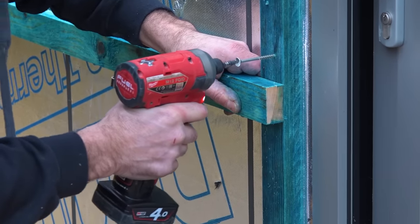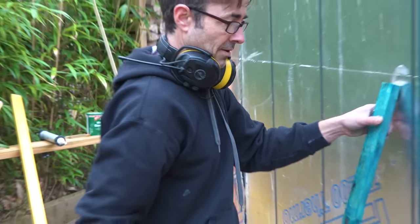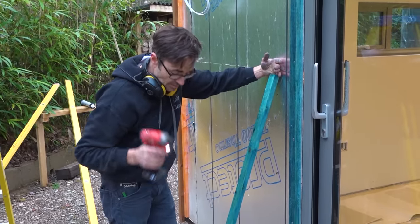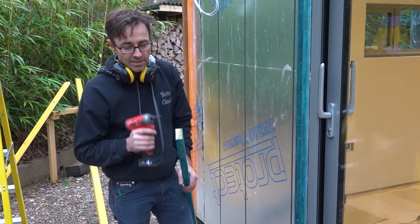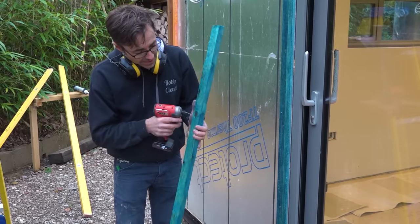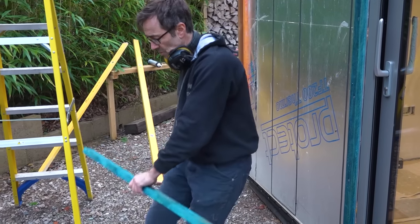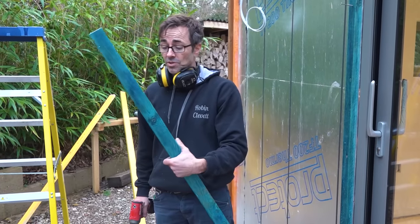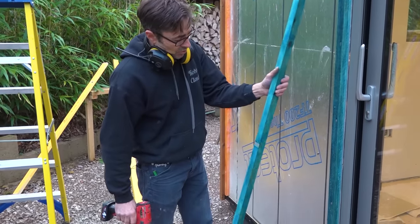And for anyone who's interested in the colour of this batten, this is a British standard batten. So on most sites, especially new builds, let's say we were doing roofing, these are the battens that you need to use to comply. And simply, they've got less big knots, which means if they're fixed between rafters and you step on it, it's not going to break. It's not just for strength, it's for safety also. They also reckon that they're much, much more uniform.